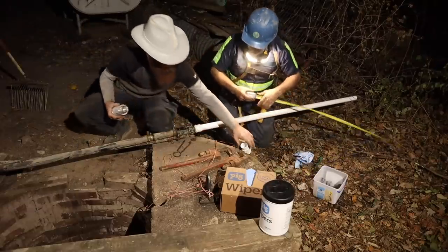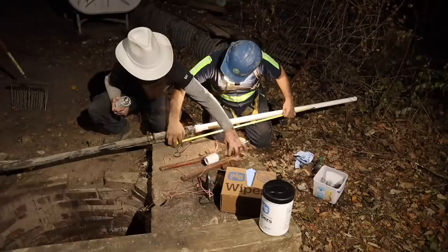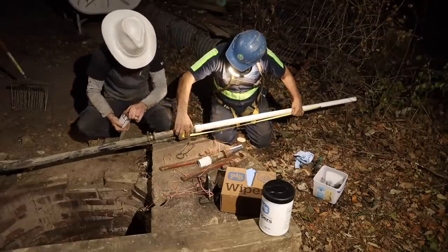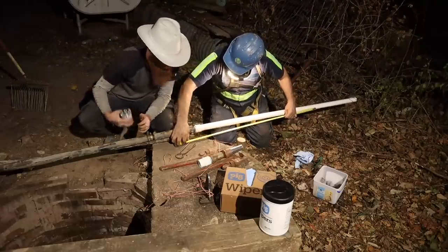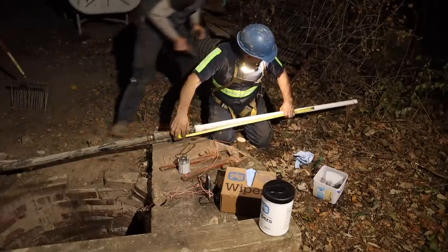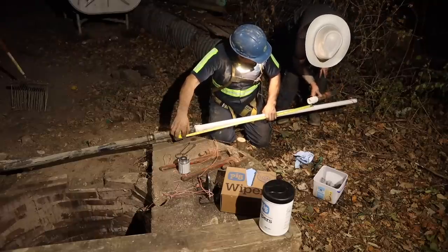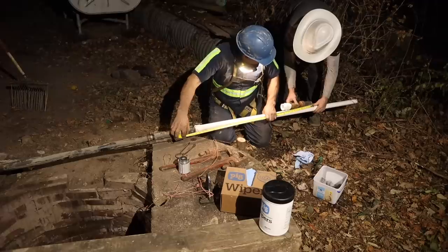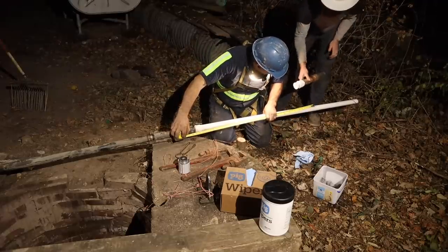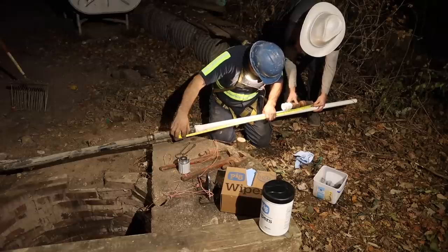All right. We wanted, to be safe, 45 was dirt. Okay. 42 from there to there. It's an inch and a quarter into the pipe. Okay. So whatever. Wait a minute. No, that's got to be the bottom of it. Bring the foot valve up. There you go. So 11 and a half. Right, cut it. Or 10 and a half, excuse me. I'm going the wrong direction. 10 and a half. Yep.